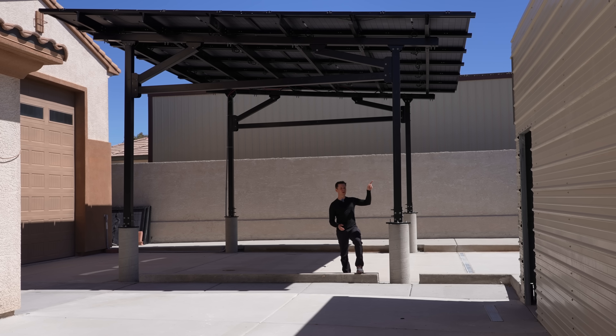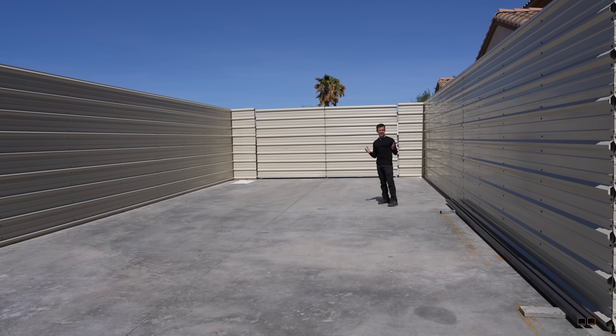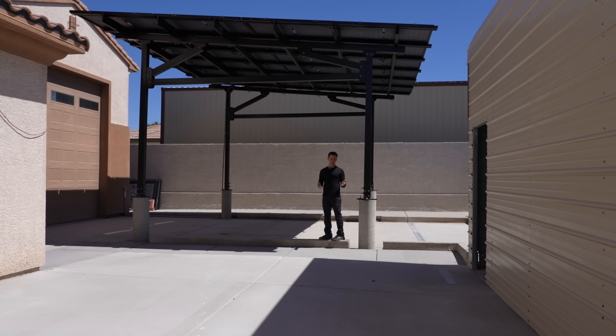There's a big difference between the bunker vault panels — when I stand on that roof and look out it's very bright, with a lot of light reflecting in my face. But right here it's all closed in and very dark. Now this outdoor environment is very bright with lots of things reflecting light, and you have to squint no matter which way you look. If we put a single bifacial panel in the middle we'd probably have the best bifacial gain ever, but a large array will shade the whole area and reduce that gain. I want more bifacial gain, but this is now a cool shaded area in the desert, so I'm not going to change a thing.